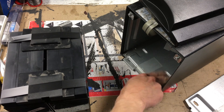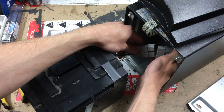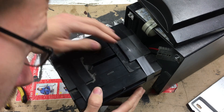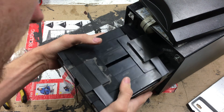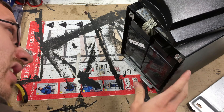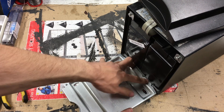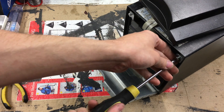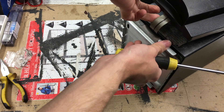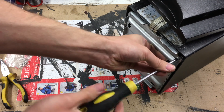Here is the UPS. I'll just get some of the dust out of the bottom. We're going to put these cells back in by plugging them in first, then sitting them in. Watch that the power connector doesn't get crushed alongside the batteries. There we go — that's in. This will now hook into the bottom again and we can fold that up, screw it back in, make sure our little control panel wire stays at the top, and put the screws back in.